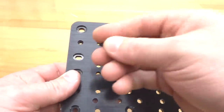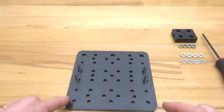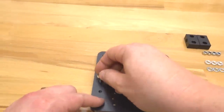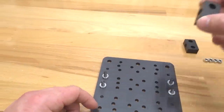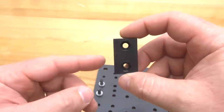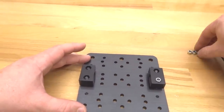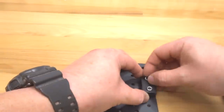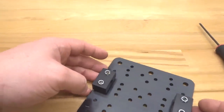So taking your 20mm screws, let's put these through the holes. Turn the plate over. So next, we'll need to take our 3mm aluminum spacers and place them on each screw. Following that, we'll add our precision shims. Following that, we'll add our nut blocks, making sure that the hexed recessed side is facing upward. Then place the nylon hex nuts into each block. So I just simply place these onto each screw, and from there we'll tighten them down. So now I'll tilt the plate to the side and mount these into the blocks.